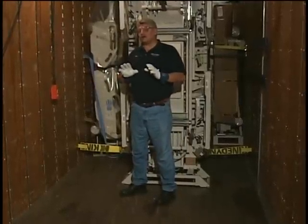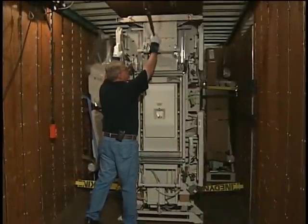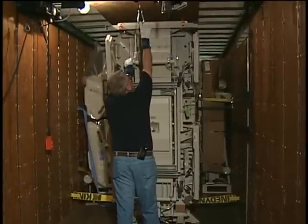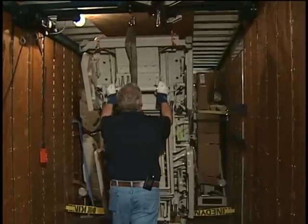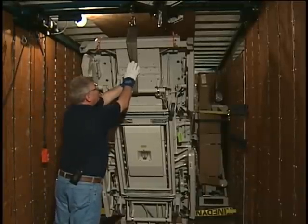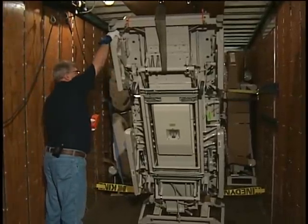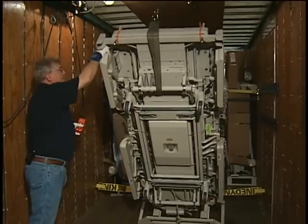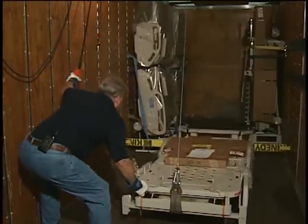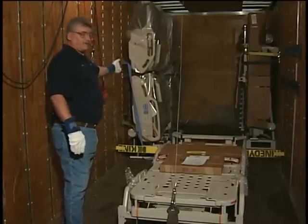Now you are ready to lower the bed. As you turn around to lower the bed, be sure your strap is hooked. Lean the bed forward, making sure the top of the bed clears the hoist. Bring it down and let it fall in the cradle. At that point you're set to go — the strap will hold that bed all day. Come back over to the controls and push the down button, bringing the bed down. At this point, the bed should kick back. You can see how the kickback strap back there stopped the bed from going into further damage on the other beds.